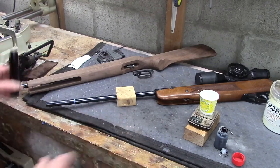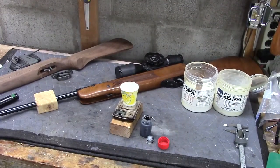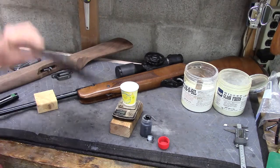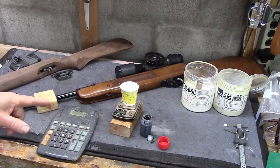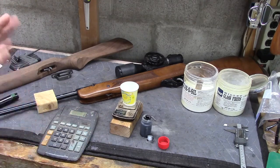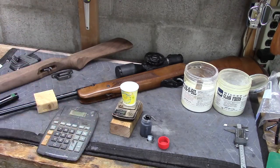Anyway, this is the way I'm going to do it. So we're going to mix up epoxy - two-part epoxy, laminating resin. West Systems Marine Epoxy is a common product. I use what TAP Plastics sells - it's very similar, they call it their Marine Grade Resin and Hardener System. I'm going to use Fast Hardener, it's a 4 to 1 ratio. We're going to do that by tareing the cup, putting resin in it, taking that number on the scale and multiplying it by 1.25 because it's a 4 to 1 mix ratio, then adding hardener until we get the number the calculator says we need.